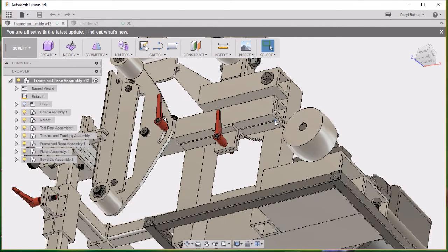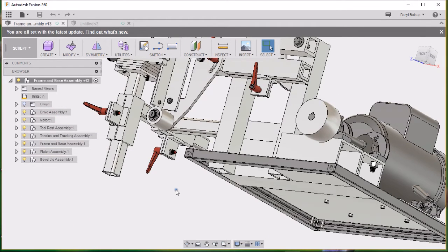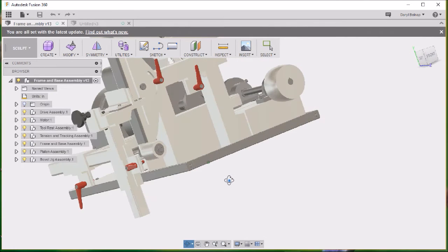And I came up with this clamping system here. I've converted my MIG welder so that I can weld with aluminum. So I'll do a little aluminum welding, weld these brackets on here. I'll cut that slot on my table saw. All of this can be cut with a Diablo non-ferrous blade. It cuts really well, actually. I've cut one of these already. I haven't assembled it all yet.